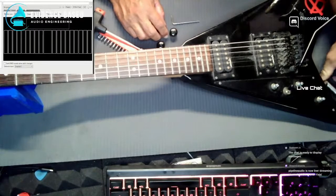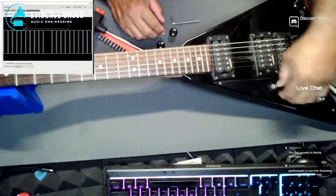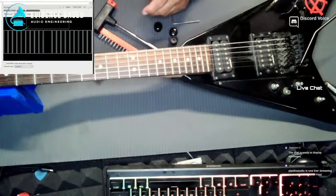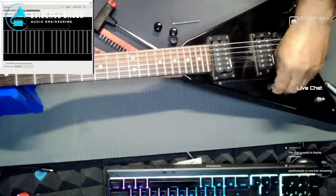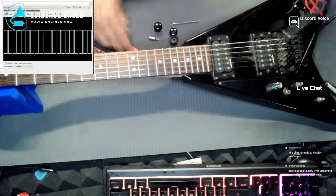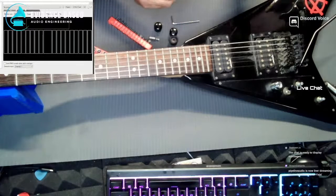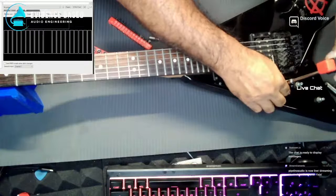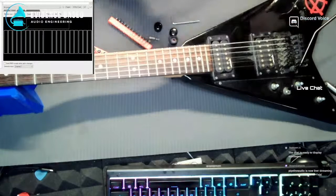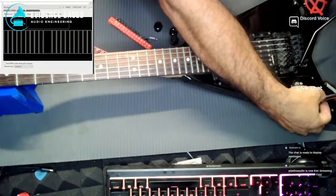So the output jack is a little bit wiggly loose too. Okay, so these guys, I don't know if they're actually loose. I don't think they are. I can turn it with my fingers, so that's probably not good. But these sockets aren't going to be deep enough for this job. Yeah, maybe they are. And I'm afraid the pot itself is going to spin under there. Maybe that would be bad. Let's see how this works. That's kind of cool. See, normally I'd want to hold on to the shaft at the top and put a wrench on here, a 7/16, yeah, 11 millimeters or so.